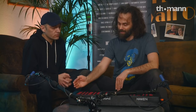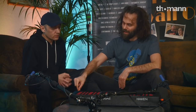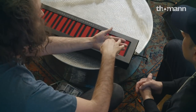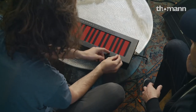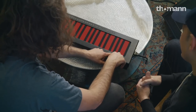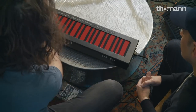The surface itself is a neoprene layer — a fairly thick neoprene layer — with some sort of textile on top, like a mouse mat but a bit thicker. Underneath there's a long array of metal rods that are magnetic at the ends. They rest on springs that give them a bit of resistance and you can push them down toward the sensor. On one typical note it's about two and a half to three rods — maybe a hundred of these total.